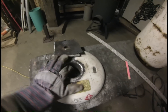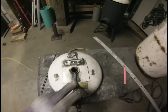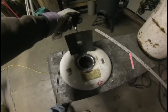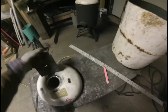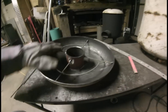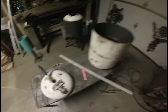I welded the pipe down the middle and ground it down and cleaned it up. I also wanted a cap with a hinge and a heat-resistant handle. What happens is I'll be able to open it up and drop cans directly into my crucible and cover it — it'll still let heat out but hold more heat with that smaller port. This is the lid I cut out of what was left over from my other tank from the rocket stove. On the bottom side I welded in some little rebars so when I mortar it all in, that'll hold the mortar from falling out.